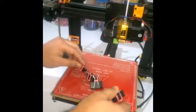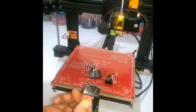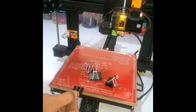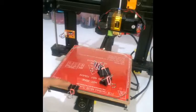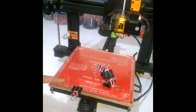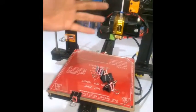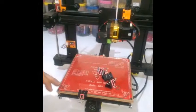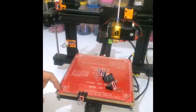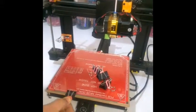You can use the binder clips like this. While inserting a binder clip, make sure it is not too close to the nut here, because once the printer starts moving it will first home to this corner. If the binder clip is too close to this corner, it might interfere with the nozzle of the printer.